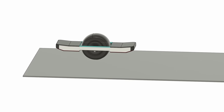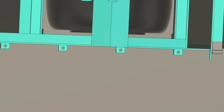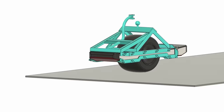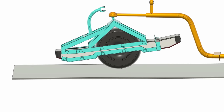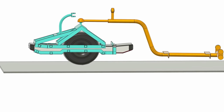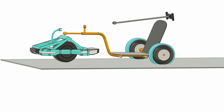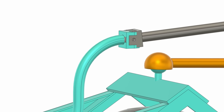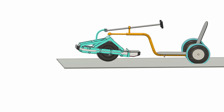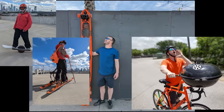I'll import a one-wheel into Fusion 360 and design the framework for the top and bottom of the board, which will bolt together through these holes, firmly securing itself to the board. The second part of the frame connects to the one-wheel's framework with a ball joint, allowing it to pivot in any direction. The rear will have some free-spinning wheels, with PVC tubing acting as drift sleeves. Then there's a seat and a steering column that slides through a spherical bearing, combined with a universal joint, allowing the rider to control the speed by pushing or pulling the steering wheel. The same for the steering.